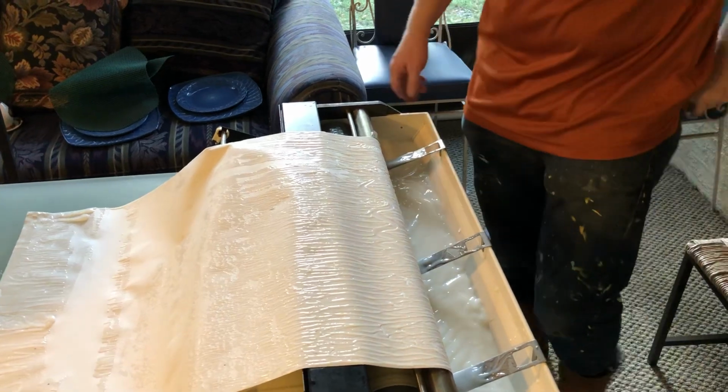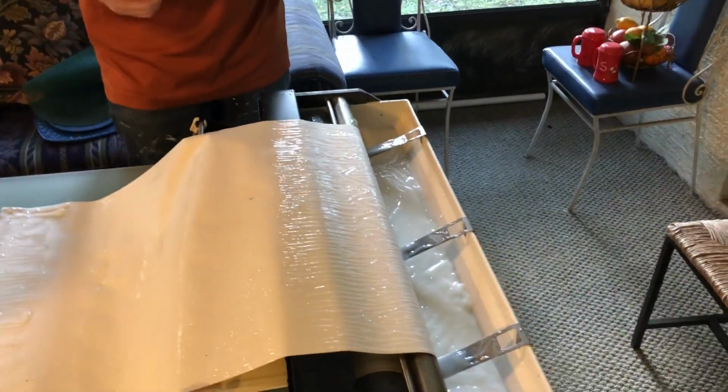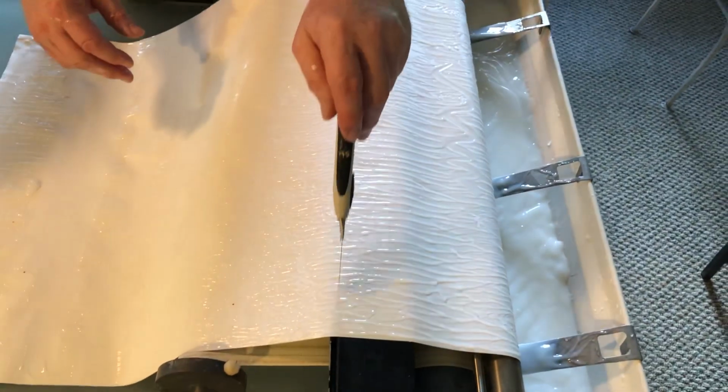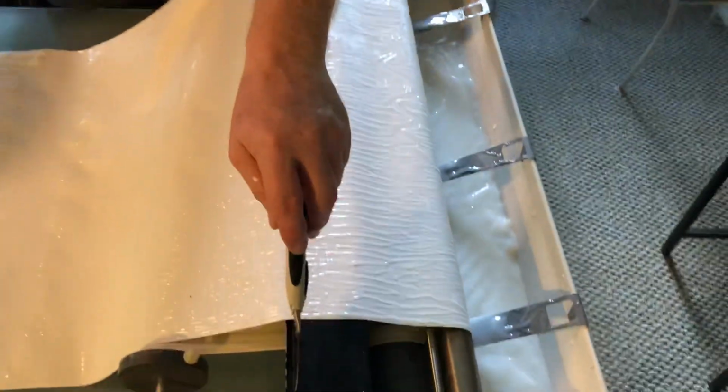The only other thing I'll show you is that when you have enough wall covering, after you measure, I don't have a counter on this one, you know, a number reader. You're going to place your knife in this thing, slice it straight across. It gives you a nice straight cut right into this groove. See that groove? Just show them closer so they can see it. See that? And then I cut my wall covering. That's how you move quickly on jobs.